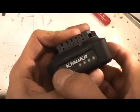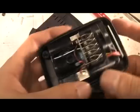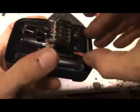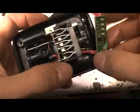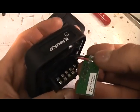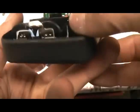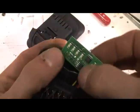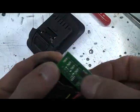We'll take a quick look at the battery, which incidentally has one of these handy little gauges on it. Now, what's interesting, this little gas gauge board, it looks like all it's doing is looking at the battery voltage. It's not attempting to do any actual gauging, because it's only got the 2 power connections to it. There's no internal battery management or even protection circuit in here as far as I can see. So this has got an Atmel ATtiny13 and 7805 regulator on there.